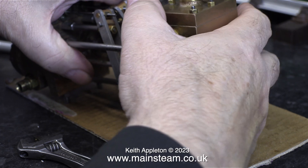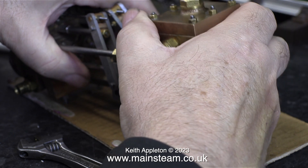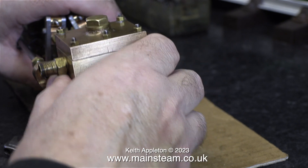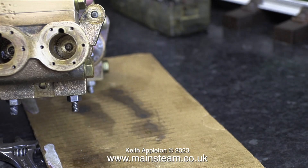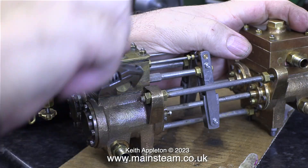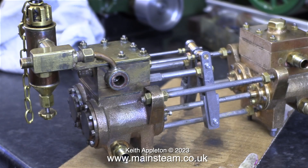But alas it's not that simple. The pistons are threaded onto the piston rods, and the nuts I removed were just lock nuts. As you've just seen, I tried to remove the assembly several times with no success whatsoever. Normally when pistons are screwed onto threaded piston rods they have a couple of holes to take a pair of circlip pliers to unwind them, but at the water cylinder end there don't appear to be any holes for circlip pliers.